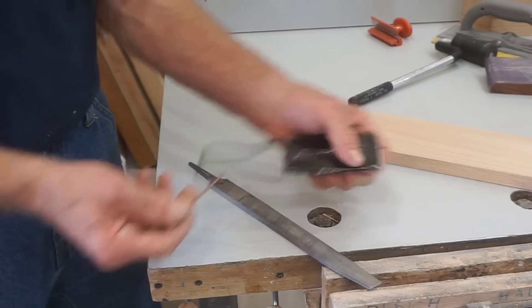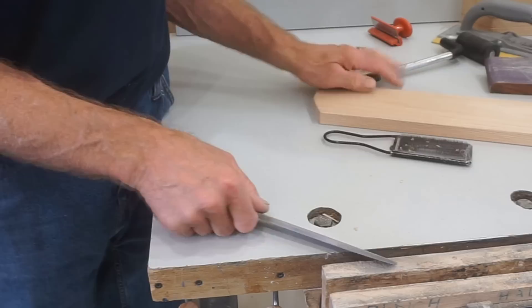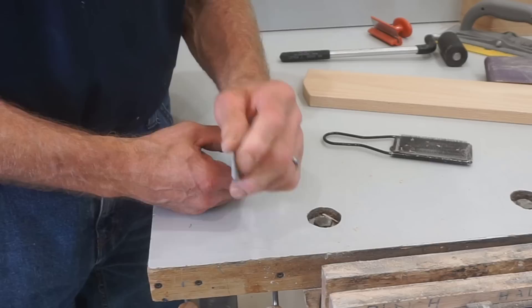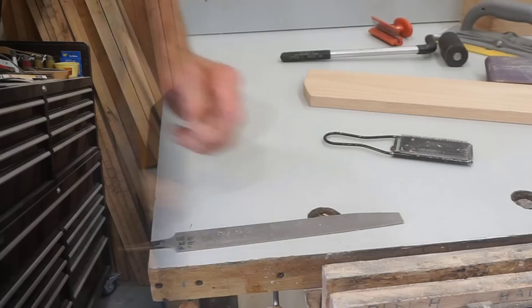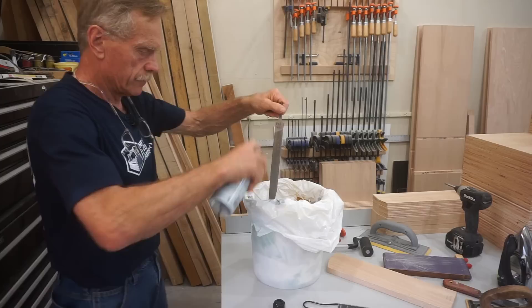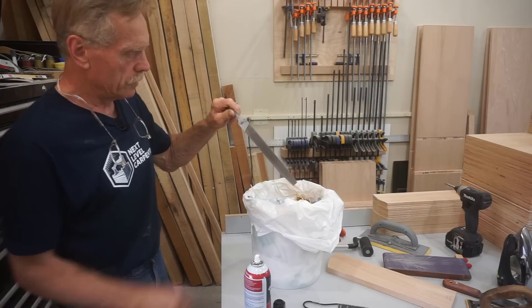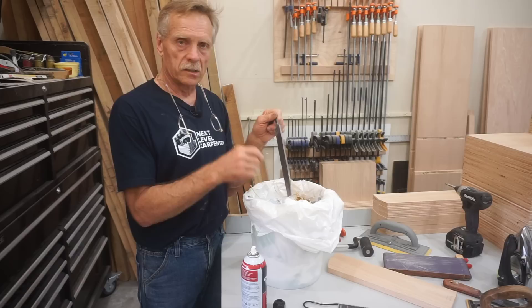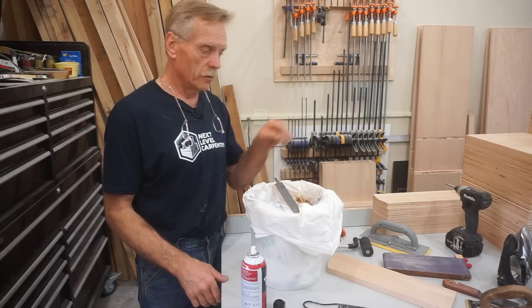I'll link to these tools in the video if it's something you need. And I'm still trying to source this file — I've put out a couple of questions on Amazon but nobody can tell me if their file has this triangular profile or if it's rectangular. While I'm on the subject of file maintenance, I'll show this silicone spray — it's 100% silicone spray. I just dust the file with it, being careful not to get any silicone on my projects. If I do this at the end of the day rather than the beginning, the carrier is all evaporated out, the file is slick, and that glue won't build up nearly as much while I'm doing a bunch of this work — even if the glue is still a little warm and soft from ironing it on.